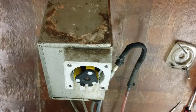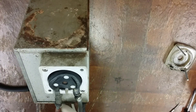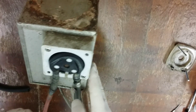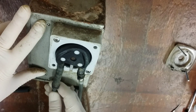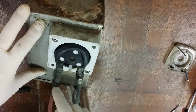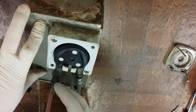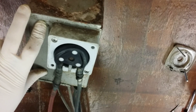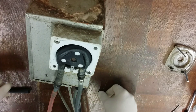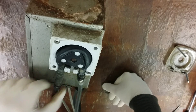You might need to look the unit up to see what hose it takes. If you replace the hose and you're still not getting chemical up the line, check this uptake hose. If it's got a slight hole in it or the connection isn't good, you're going to be losing air. The chemical is trying to suck up but it's taking in air because it's essentially a vacuum — that's how it picks up the chemical. So if there's a slight hole or crack in one of these hoses, it won't work either. You'll need to replace it with a new hose and make sure you have a nice, perfect seal.